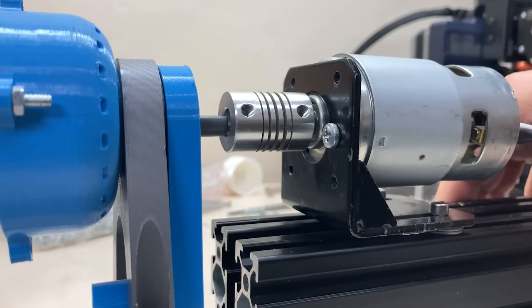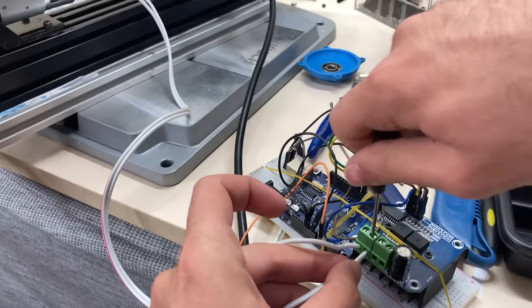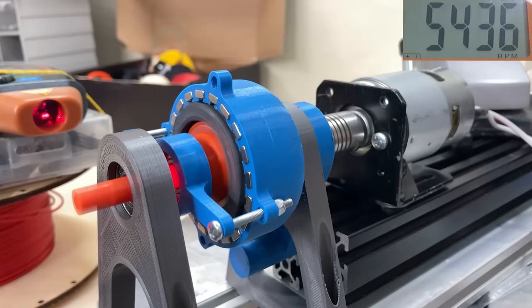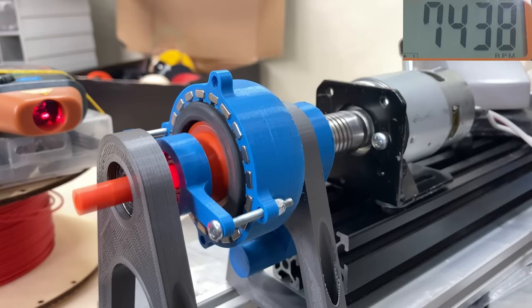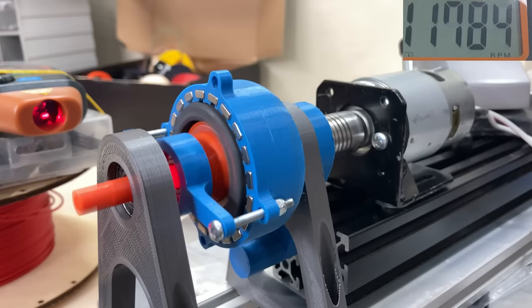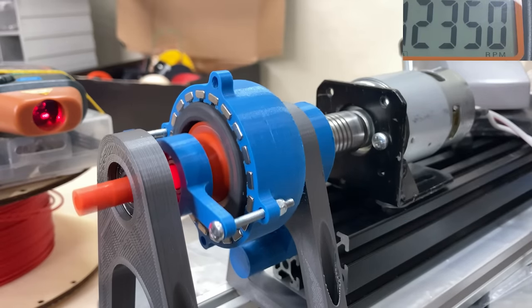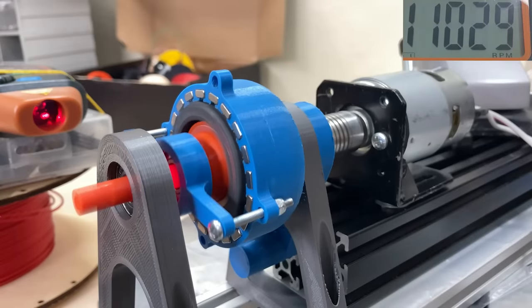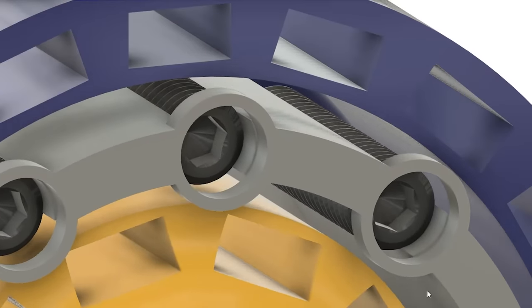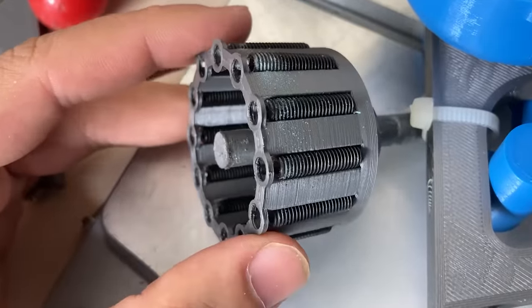This modulator can go up to a maximum of 3000 rpm, and with the 6× gear ratio magnetic gearbox in front of it, it can theoretically reach up to 18,000 rpm. I was curious what would happen at such high speeds with these 3D printed parts. To be honest, it's not what I expected — there's a little wobble and you can see particles flying in the air. Although the design looks easy, it can be challenging to get precise tolerances with 3D printers, and if there is wobble in the mechanism, we may face these kinds of results.